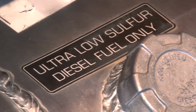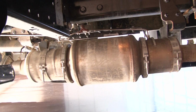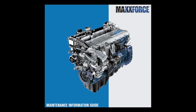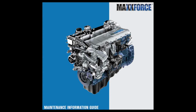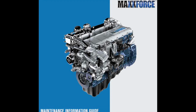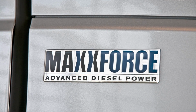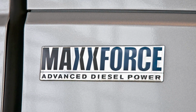Ultra-low sulfur diesel fuel is required for all on-highway diesel engines using advanced aftertreatment systems. For complete details on fuel requirements, see the Engine Operation and Maintenance Manual supplied with the vehicle. To determine acceptable biodiesel and biodiesel blends, refer to the Engine Operator and Maintenance Manual for the applicable engine. MaxxForce engines should not use biodiesel blends higher than 20%.